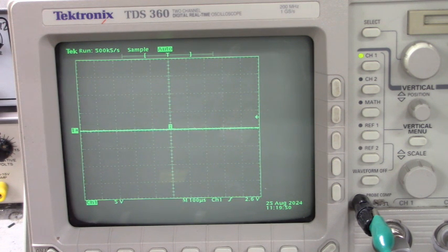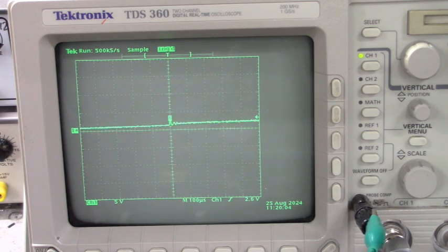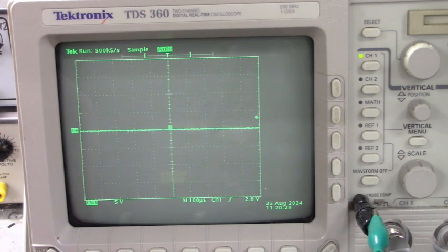Now, let me disconnect the oscilloscope ground from logic ground, the input side of the optocoupler. We'll go look at the output side of the optocoupler. All right, don't get across that DC bus, Pete. I'll try not to. Okay, there, pin 5 of the output side optocoupler, that's ground. Let me get my print over here of that optocoupler. Let me see who the output is. Okay, the output is pin 7 and pin 5 is the ground side of the output.